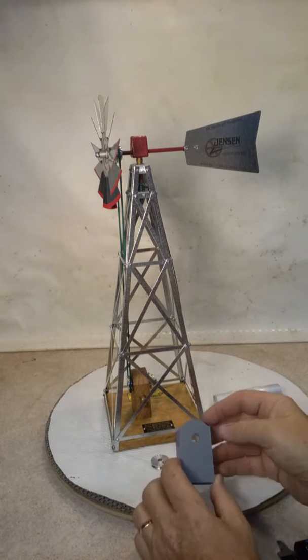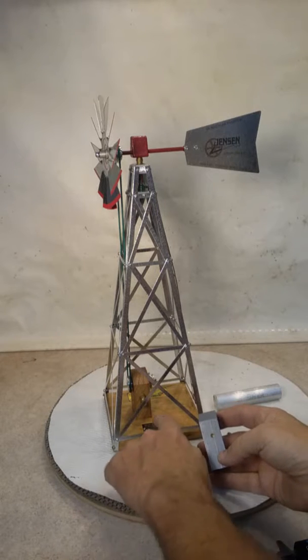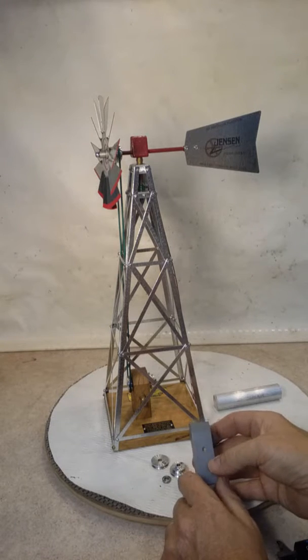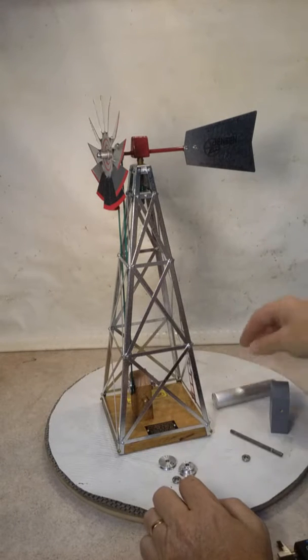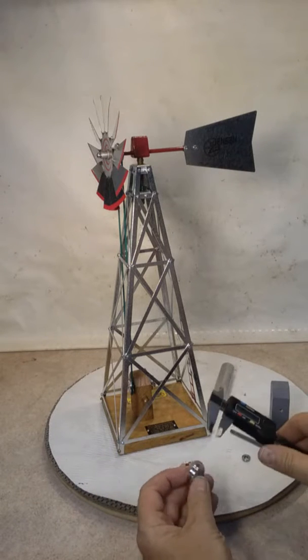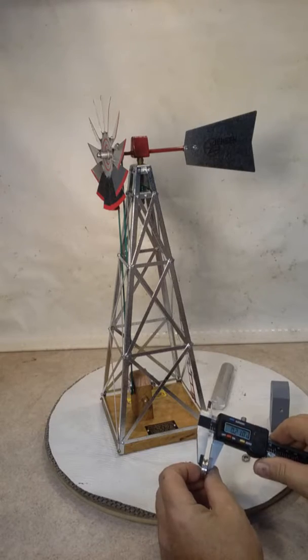And of course, I just gave it some 45 angles on the top. That's a 3/16 hole to accept a PM Research elbow, and you can use a 1/4 inch or 3/16 inch. Both look well, and I've used both, so that's not a problem. The pulleys on the bottom, all of these were made out of 7/8 aluminum round stock, and I just start with that. And this one's 0.210, but it can vary.